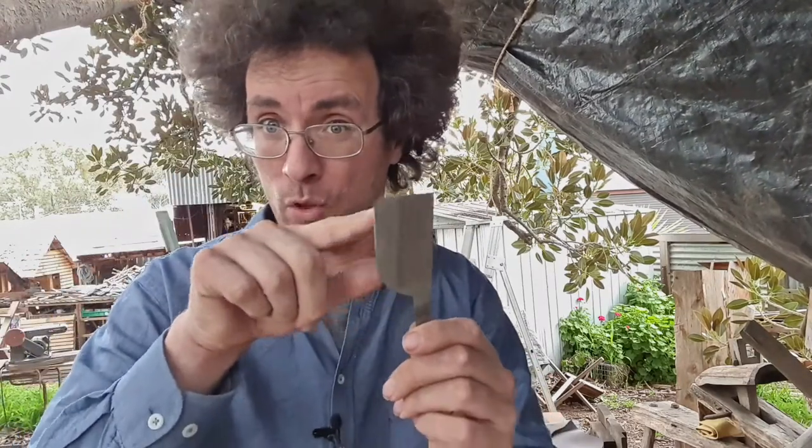What I need to do first is grind out that chip and put a camber on the blade. You often see these in Japan in all sorts of shapes — straight edge, straight across, a full half moon camber, or possibly even a quarter moon camber. I'm going to try a quarter moon camber to see how having a point on one side and the curve on the other gives us some flexibility. I might put a handle on it — I haven't decided yet, because that's a pretty convenient shape just as it is. And in Japan, you see them both with handles and without.